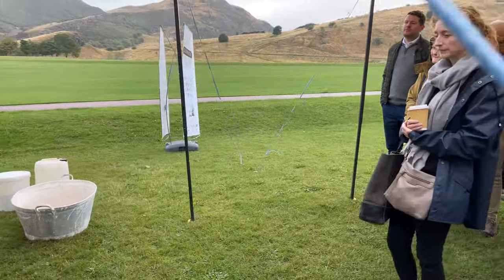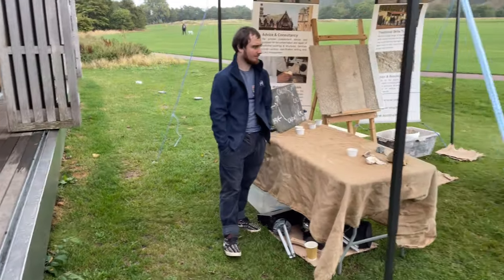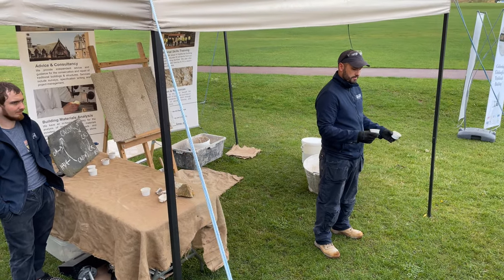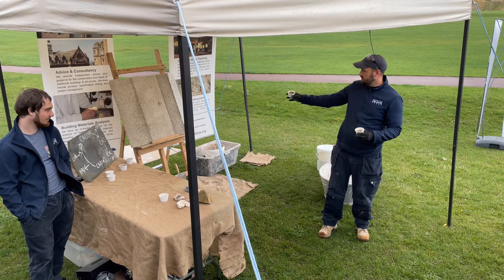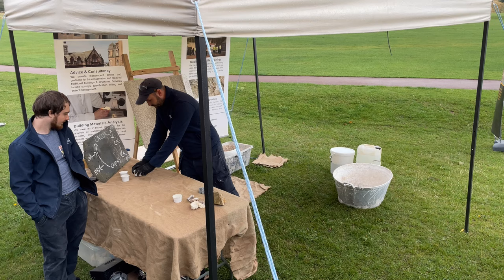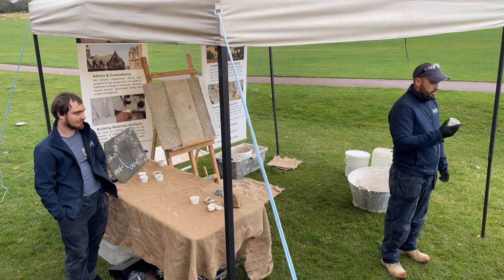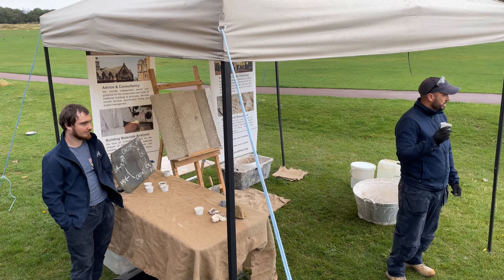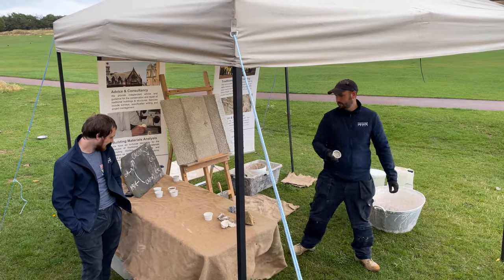Here are two samples of sands you would generally use for harling. All your harling is done with sharp grade concrete sands — never with a building sand or a fine sand. You need the thicker grains to give you that lovely texture on your house. Once combined, you get your wet mortar — like this mortar I've made from sand I got from a beach and limestone I burnt myself. Best mortar in the world.